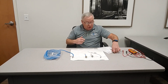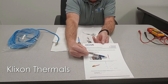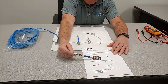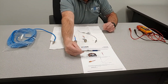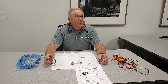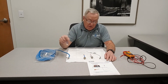We have three different sensors, but in multiple different configurations. The first one we'll talk about is a thermal. The thermal is a small two-wire that's actually embedded inside a phase of the motor — there's three in a three-phase motor, one in each phase in series, coming out with two wires. When we take a reading across those two wires on an ohm meter, we're looking for a closed circuit, somewhere around one or two ohms. I'm not really concerned about the exact resistance; I just need to have resistance through there to know I have a complete circuit.